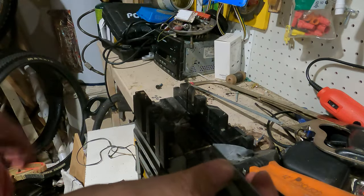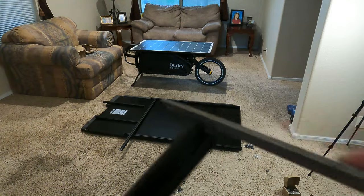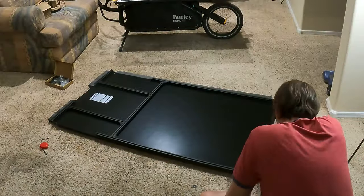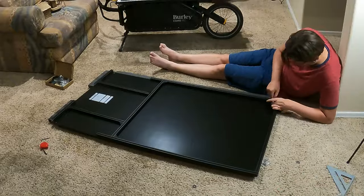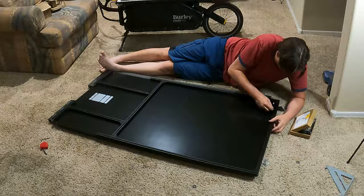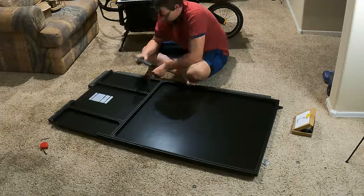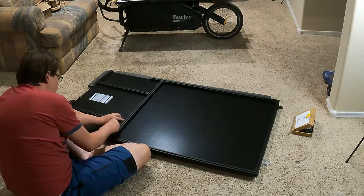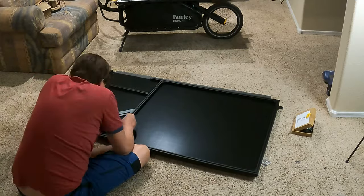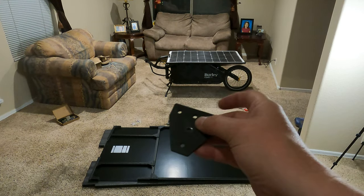After the cut, I take a file to the end to clean it up. With everything laid out in its basic form — bolts and corner pieces inserted — I come in with a ratchet and a square and start tightening everything down, pulling out the tape measure to make sure the rails are right. Everything is readjustable, which is one of the cool things about 2020 extruded aluminum with T-brackets and corner brackets.